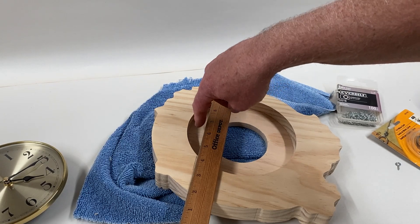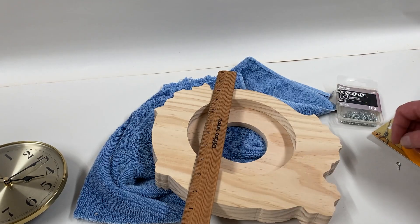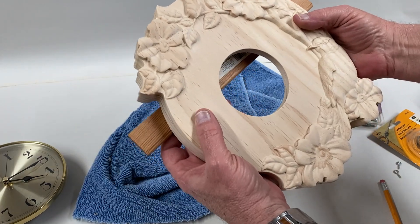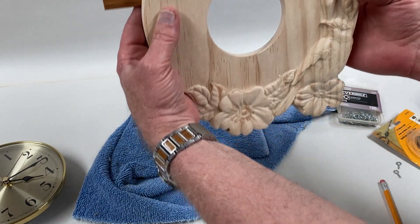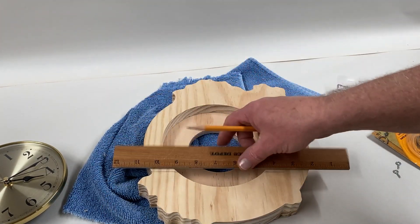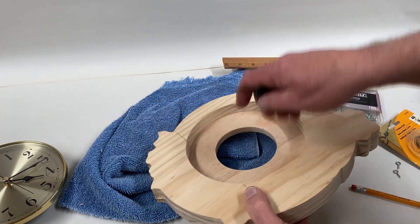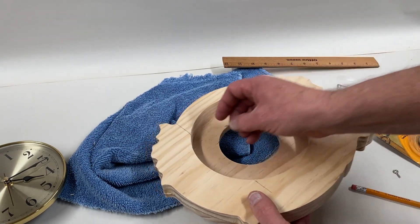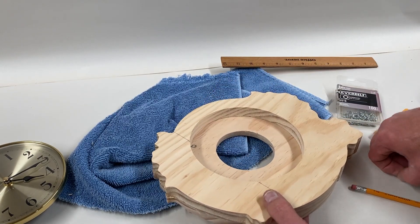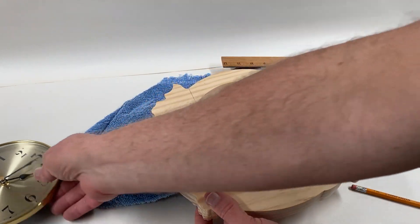You could just hang this over a nail on the wall, but I like the wire going across because I can adjust it back and forth to make sure it's staying hung straight. So what I did was I took a straight edge, turned the clock over, got the clock in position where I thought it should be for hanging on the wall, turned it back over, and made my marks. I extended those marks and used an awl to twist into the edge, giving me a good pilot hole for the screw eyes. I'll remove these for now since I still need to apply a finish, and screw them in permanently afterward.